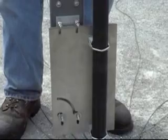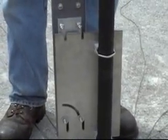When standing in front of the antenna, lift until the upper bolts clear their slots, then slide the assembly to your right and lower it slightly until the pivot bolt rests in the pivot keeper.